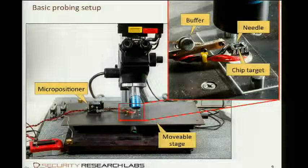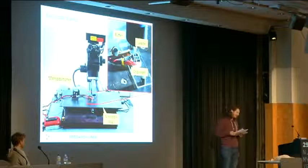That is because we need something to stimulate the chip. Whenever you probe something, not only in this case, you have to set the chip in function. You have to give it an environment where it can work. Basically, a controlled environment. If you do the thing that Carsten mentioned, then you also have to take care about clock stability and synchronizing things.